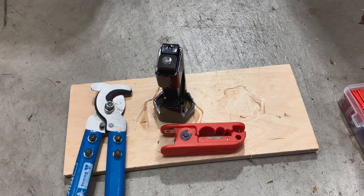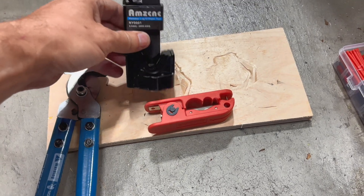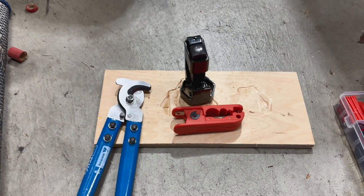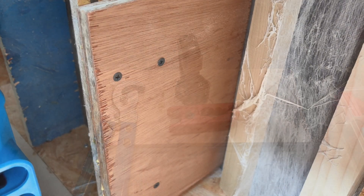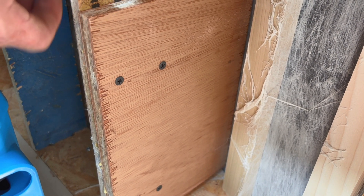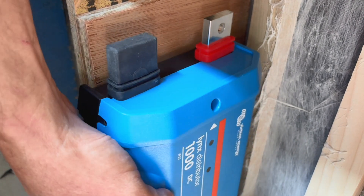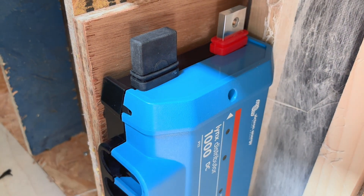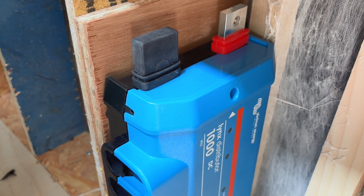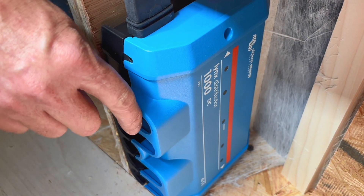Just as I did when I put the batteries in parallel, I'm using my Timco cutters to cut the cable, my Amaze CNC crimper, and some strippers I picked up on Amazon to make my cables. To mount my Lynx distribution box I cut a piece of board, glued and screwed it into the center support here on the seating to give me a place to mount it. I'll put the Lynx distribution box in here, which saves me wall space because there's not a whole lot of space in this compartment to work with.